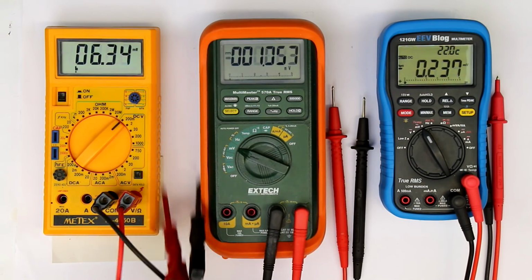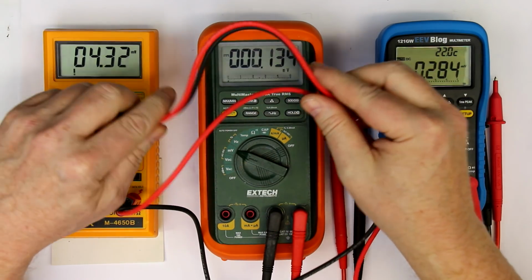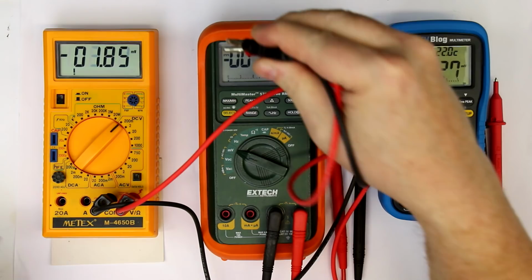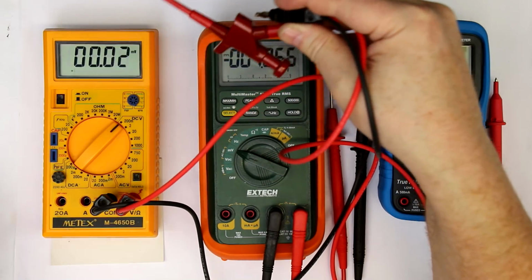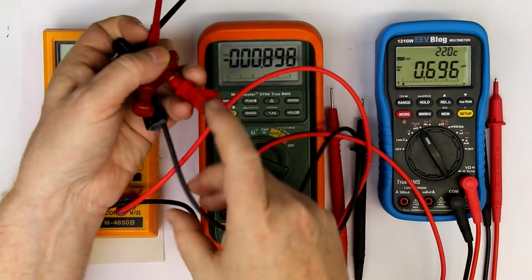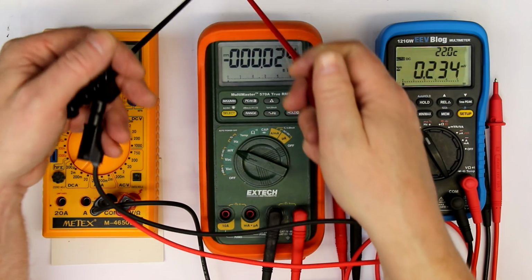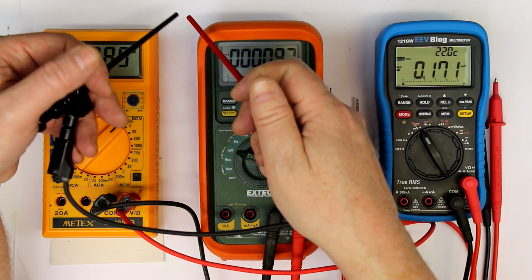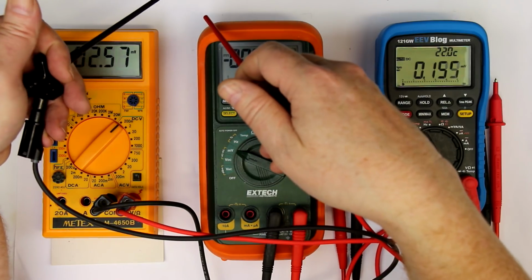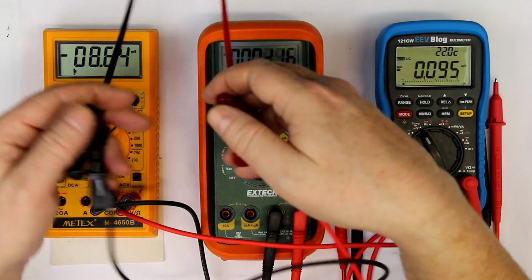And the advantage of these silicone cables over the traditional or cheap PVC cables is, first of all, they are extremely flappy, so that when you're probing something, or even if you use the grabbers, your cable does not provide any extra force, and your grabbers are attached to your test points with the least possible force or torque. Because sometimes your test points that you want to clip on are so delicate that if you apply any force, even your grabber will jump off or whatever.